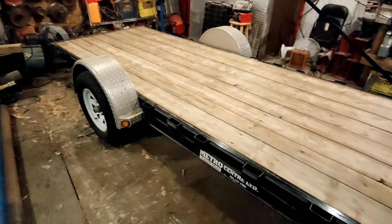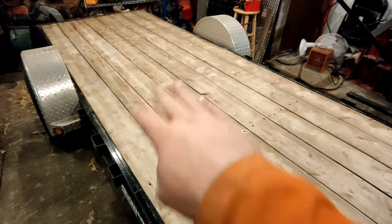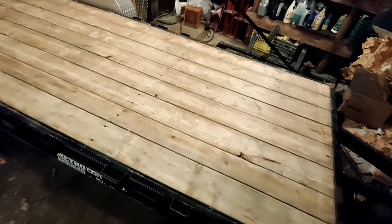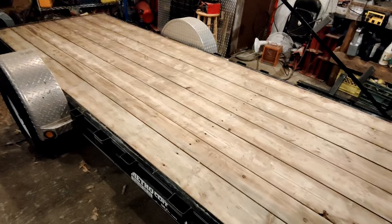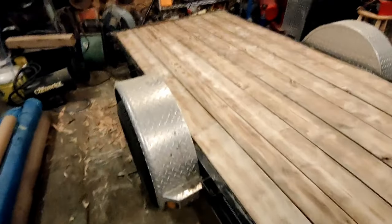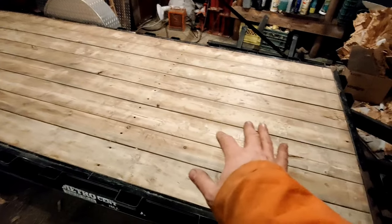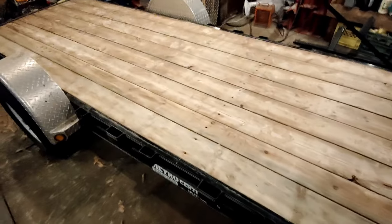Okay guys, got it all cleaned up. Took a chisel and a hammer and took off all the little nubs that were on there with glue and wood. Then I took my belt sander and went over it just lightly to get any glue and any remaining wood residue you could barely see. It's all nice and smooth. This is pressure treated lumber already on it, but I sanded the top off so a little bit of protection is gone. So I'm going to put a coat of stain on it so it seeps in nice and deep.